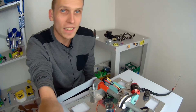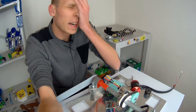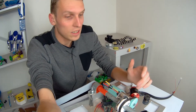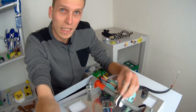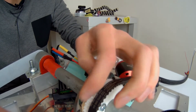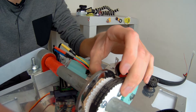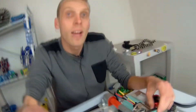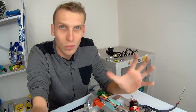We were so close — I almost thought I was going to have a really positive update here. So basically, it's now the next day. I realized when I woke up that I hadn't actually mounted everything properly. Down in by the actual belt system, I hadn't put in this little back piece and hadn't tightened these bolts down, so that's where the wobble was coming from in the belt, and that's why the tooth was skipping. Which is a good thing — I know I need to have this all pinned down and fixed.